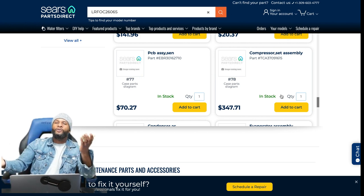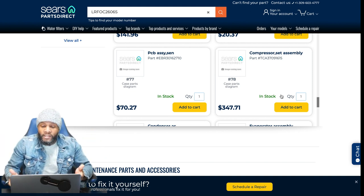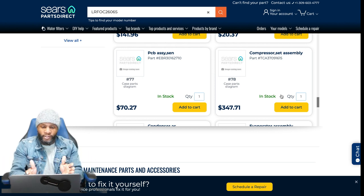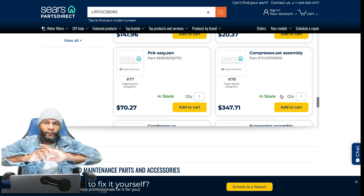Alright, so let's look at the compressor. Again, we talked about the warranty. Check out the warranty portion of the video. If the compressor is not covered under warranty, you're going to spend $347.71. So roughly about 400 bucks for a compressor, and I'm just being nice. Then there's the labor that you probably would need, because you're going to need additional parts to replace the compressor: the service valve, the filter dryer.